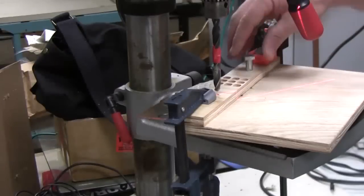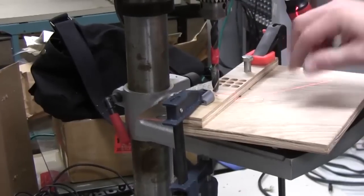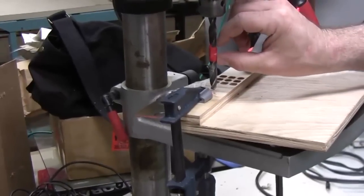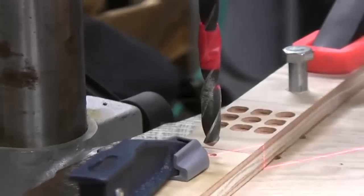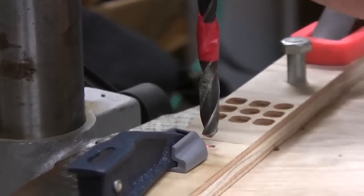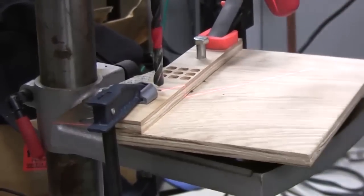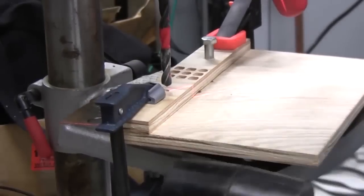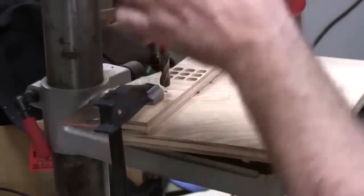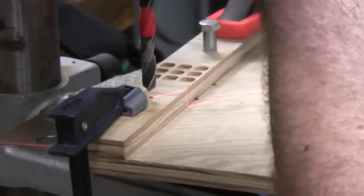We have this pinned together in the first hole and we've got it aligned with the bit to drill the second hole. Two things I didn't mention: it is a good idea to have a depth marker so that you know when you've gone through both pieces and into the waste piece. Also, when checking alignment in those two directions, you can use a rubber mallet — or even just the handle of the mallet — to gently knock it and do those last-minute alignment adjustments before you really clamp it down tight. Then double-check that alignment in both directions. That seems to be good, so we're going to drill this.